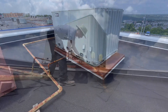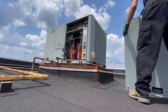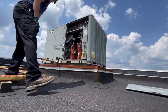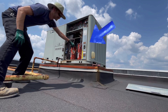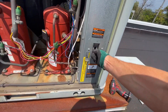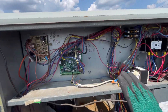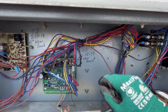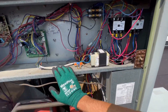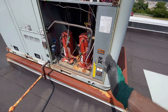If we have no power, I gotta check the breaker. Well, I can see the problem already — power is off. I wonder if somebody just came here and did maintenance, because that disconnect is not tripped. If it was tripped, it would be dead center. So treat it like it's alive. I've been here before — let me look through my notes and see what I did on this one. Let me check belts and filters just in case. If those are brand new, most likely somebody was here for maintenance and accidentally left the disconnect off.